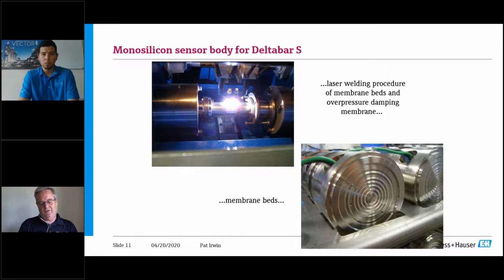So the next thing is, now let's talk about a third layer of protection we put on the transmitter. The sensor capsule itself is made out of a material that is a forged bar stock. Why? Most sensors in the market today are made out of a cast, and they will cast them, then machine them, and then weld on the diaphragms to do the measurement. We do it different. Since we use a forging, the first thing is forged metal, as most know, is very low in porosity. One of the studies that's been done over the years is why transmitters drift and fail over long periods of time in non-severe service. The reason for that is because the fill fluid, that internal silicon fill fluid, will actually absorb into the porous body. So by going to a forging, we're trying to reduce the failure and extend the lifetime of the device. So that's just one of the simple things.